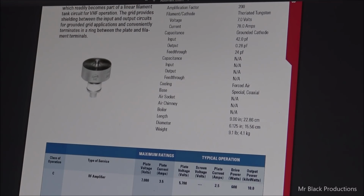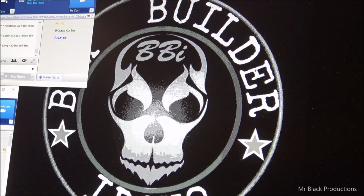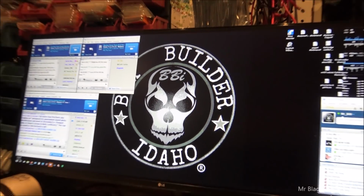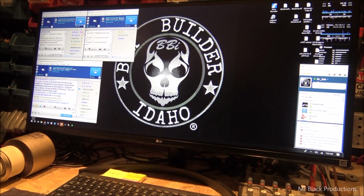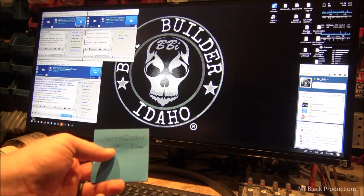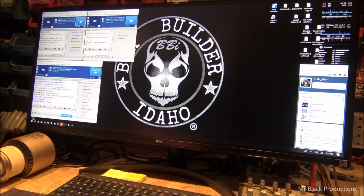Now, we're done with this. There's a couple different things we can do. You have a primary and a secondary. Okay, primary is where the voltage and amperage comes in from your wall, and secondary is the stepped up or stepped down voltage on any transformer. Now, if our end goal is going to be somewhere around 5,600 volts or 4,200 volts, we want to build ourselves a 15% adjustment window into the transformer.